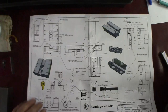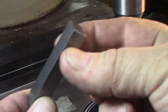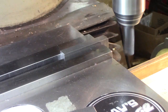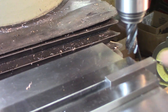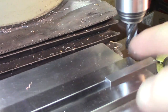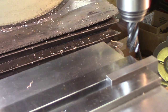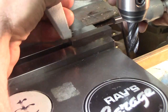I deburred these and we're just going to clean the ends up and then mill them to size. I measure and calibrate the DRO for the length, and then we'll just mill it to two inches. We're at 2.149, and I punch that into my DRO. Now I know exactly how much I need to come over to get two inches.